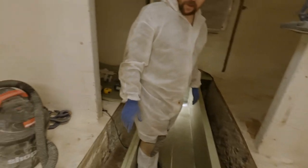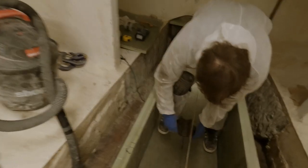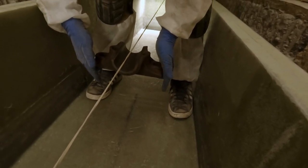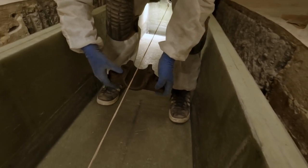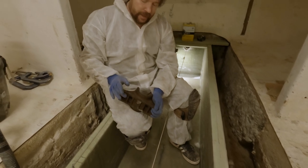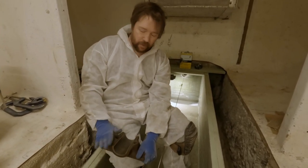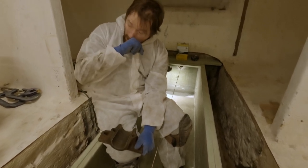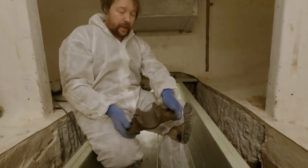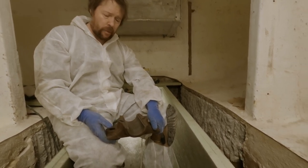The important thing is that the line comes through. Now we can take our bearing and once we determine exactly where it's going to be, just bring it in here and kind of eyeball it, get an approximate height of our bearing blocks. We will need to leave some space below this probably for a split roller bearing - the form factor on them is a little bit deeper. It gets pretty shallow over here and that split roller bearing is taller, but we're hoping there's room in there. If not, we'll just go with this standard one - it is tried and true - but we wanted to be able to leave space to retrofit it to the other one in case that's something we want to do in the future.